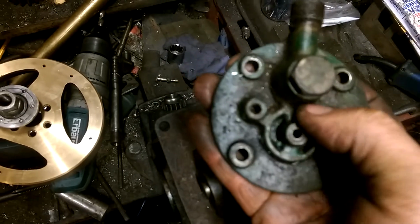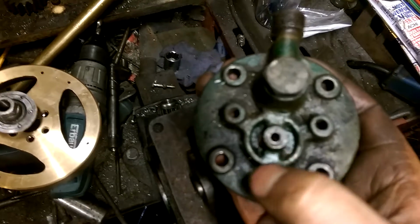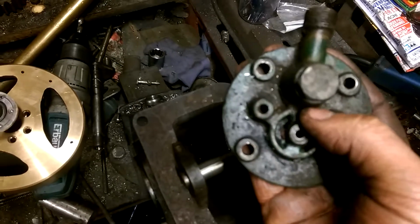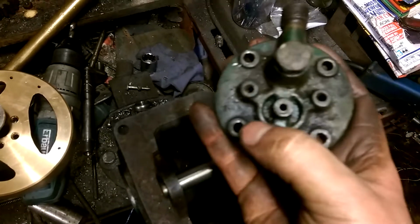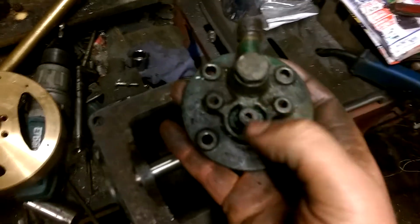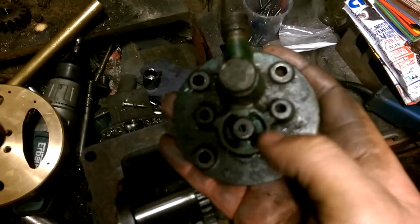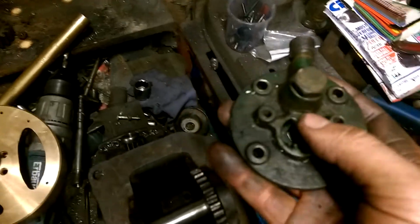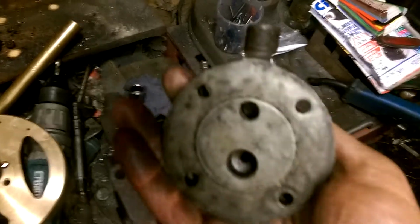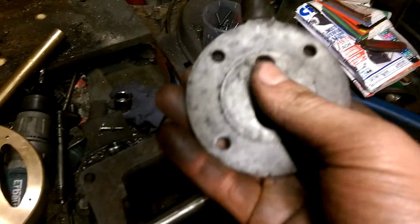Exhaust valve cage, I'll just mill around that ring there, mill it flat, make up a cage using sort of a pipe fitting or a home hacked out piece, and then just clamp it down with a bolt through each of those 4 things, and sort of a clamp just to lock it all down, probably with a copper washer in there to just keep it sealed. And that'll be the exhaust. Just use the original cast iron guide. I might bush it and put bronze or brass in, but I don't really see much need at the moment.